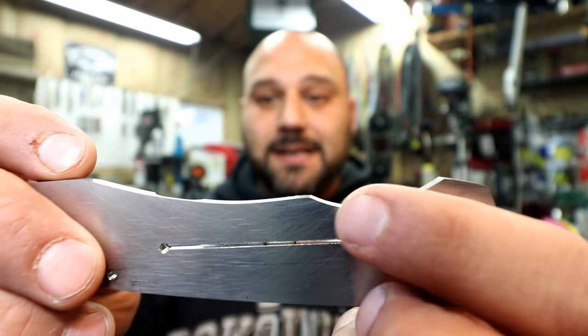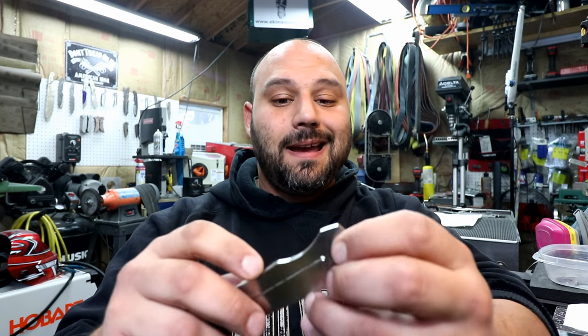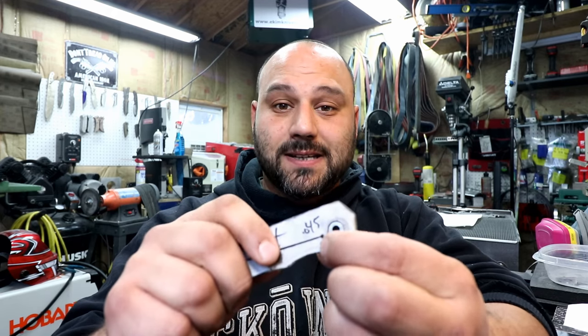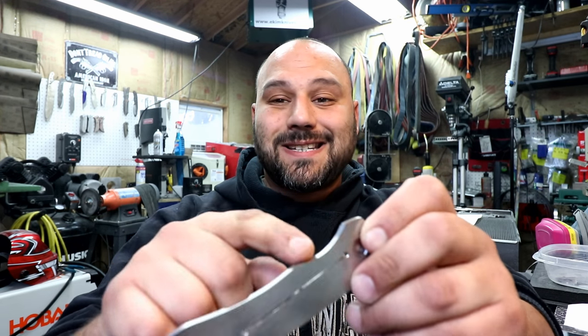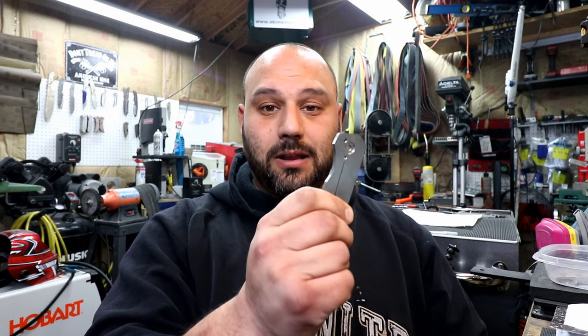In this episode we're going to chamfer the inside. The nature of a frame lock knife is that to unlock the knife you have to stick your thumb in the frame and push it over to the side. So the last thing you want are the inside of these choils to be sharp. We're going to soften those up, put a nice little chamfer in there, and after we do that we'll release the lock bar. We don't do that until we make that chamfer so it's nice and even, because otherwise when you're pushing into the wheel it's going to push half of the lock bar out of the way. There are ways around it — you could clamp it if you already went ahead and cut yours, it's not the end of the world. You can clamp it together with a clamp and cut it that way. I just prefer to do it this way.